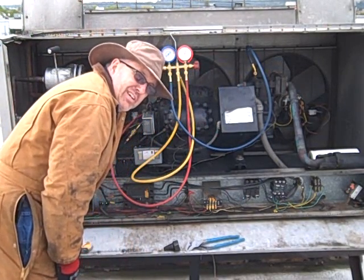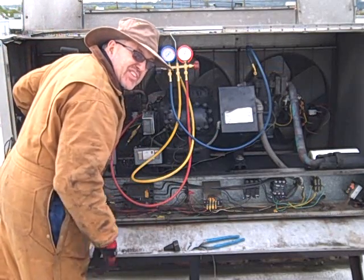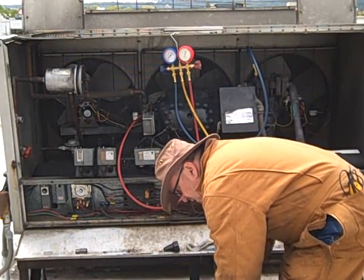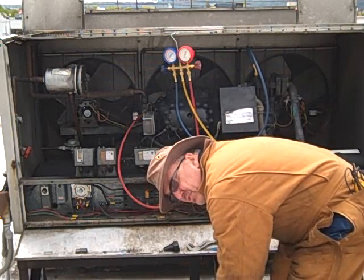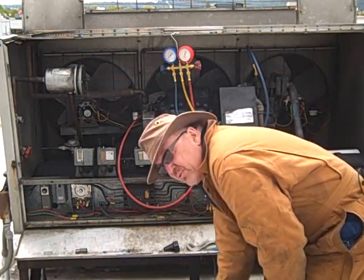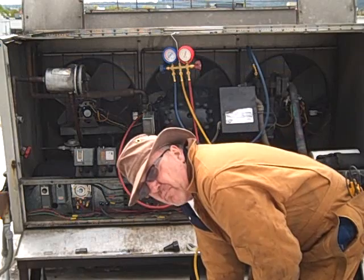We're going to add a little bit of oil, add some refrigerant, and we're almost ready to turn this baby on. This is the fun part. I've already done all the prep work so you don't get to see that. I added some POE oil and filled the sight glass up to halfway — that's what Rex likes, halfway when it's not running. He's the one that taught me, so that's what I do. Now I'm getting ready to set up some refrigerant here and top this off.